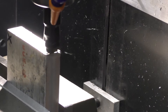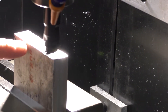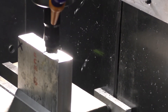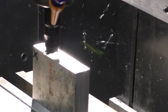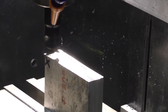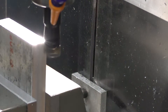I've only taken off about 10 thou. I'll take another cut to get rid of all the dents — because I used this for knocking in some bearings and beat the heck out of it on the ends. We'll get that all cleaned up, sorry about the compressor noise. A quarter cut here, 250 thou, and clean it right up.